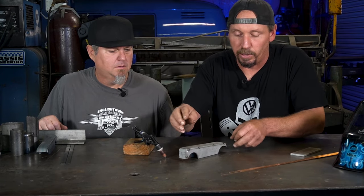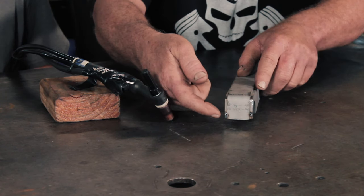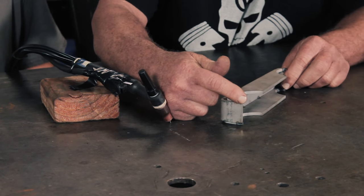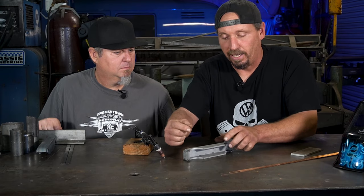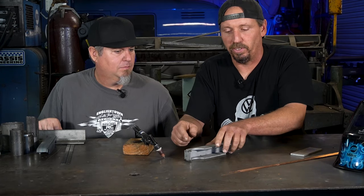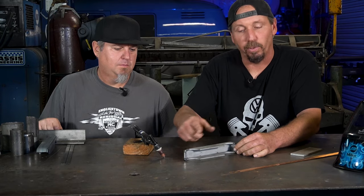A couple of ways you could just set the part down - if we were going to weld this, welding across the top here is not a problem. But to weld up here, you've got to go up. Just take this part and flip it on the side. All of the welds will be the same direction so you don't have up and down, you're going to be laying flat and you can keep your hands positioned on the table so you're not shaky. You always want your welds to go the same direction.